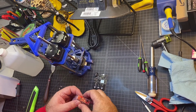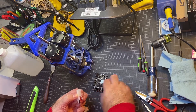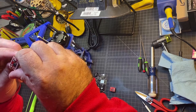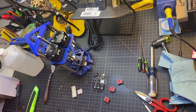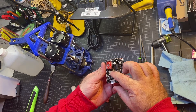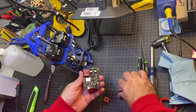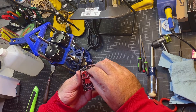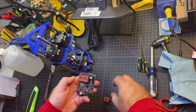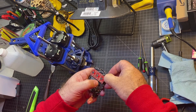I'm going to go ahead and get the board ready — put some steppers on and then put the heat sinks on them as well. Here are the steppers that came in the kit: A4988. If you look on the chip carefully, based on the picture provided, you want the potentiometers on the steppers to be closest to the ESP-12F chip. The potentiometer is this little screw — that's how you adjust the motor current or the V-Ref for the stepper. Just make sure they're all oriented the correct way. You don't want to get these backwards — electronics are not as forgiving.